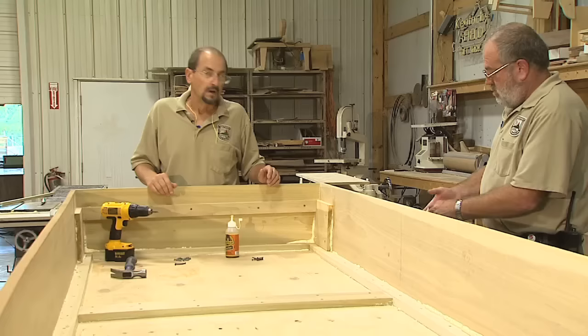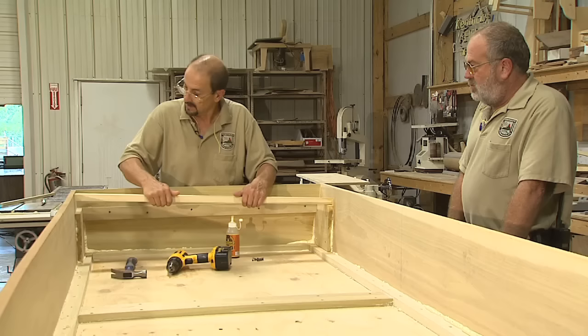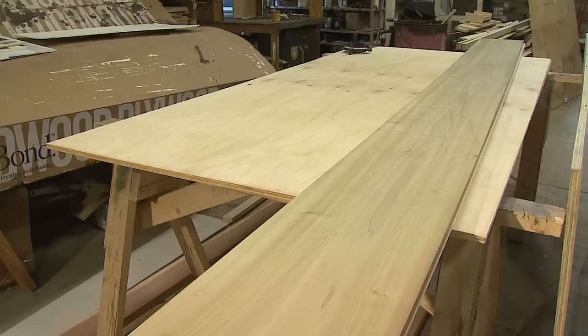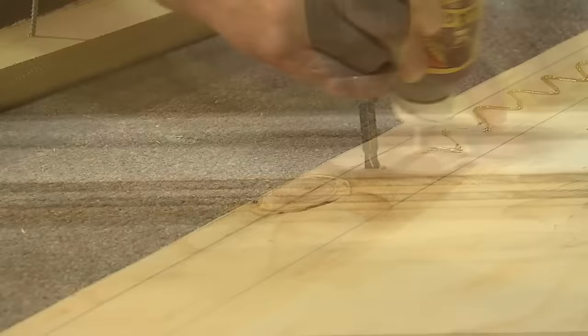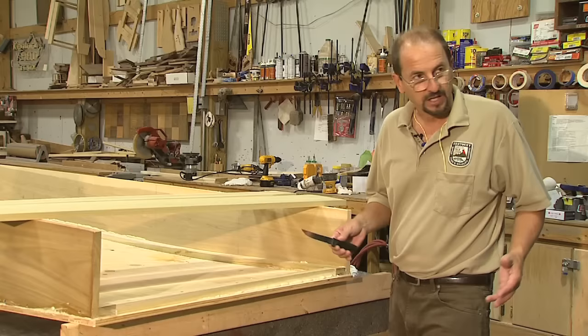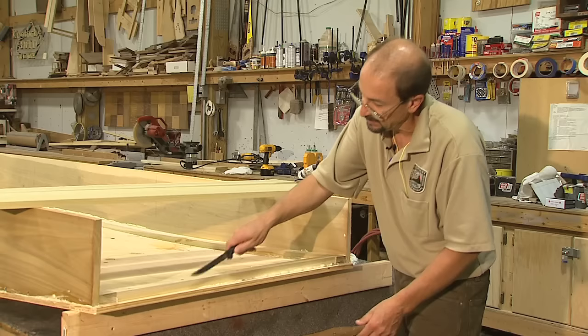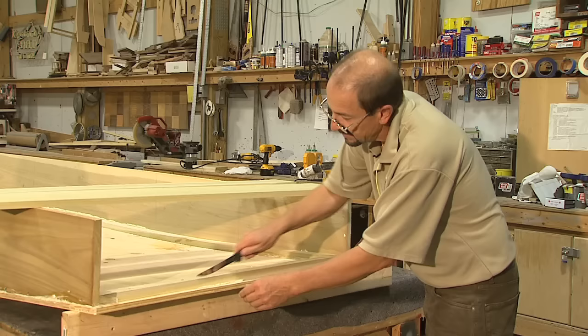Just like the previous one, we're going to add the front cleat into it — we pre-drilled it. When you're dealing with some small wood like that, if you put a screw in too close to the edge, you're going to split it. So we've washed it, we're going to put some glue on it and set it in place. It has the same three-degree inset cut so it slides and matches the angle of the back of the boat. Everywhere we've put on glue before putting another board somewhere, we've got this expansion of foam glue. Two or three hours after you've glued it, come back when it's pliable enough, take a knife and cut right down on it, slide it across, and it pulls out just like that — clean as it was before.